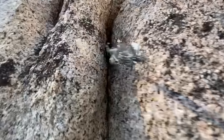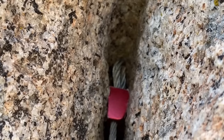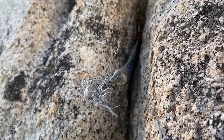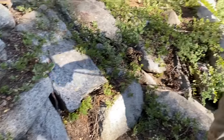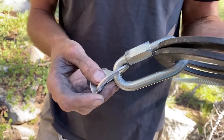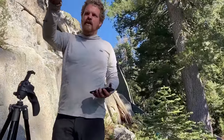Oh, no way. Yeah. So inside, let's start with this. Inside, the wire bounced back through the head. It came off and out. And then the shock from this. So this was the hole. Where's the bolt? It snapped the head. It didn't pull the bolt out. No, it snapped it. I think that's an example of shock loading because from this, it looks like that failed, then this failed. But this failed second.